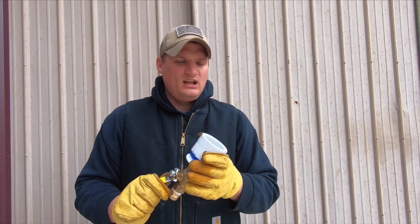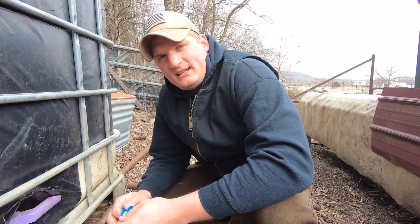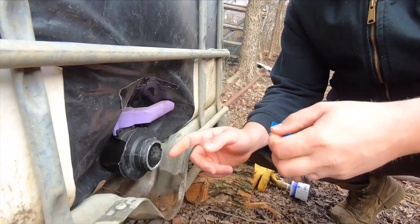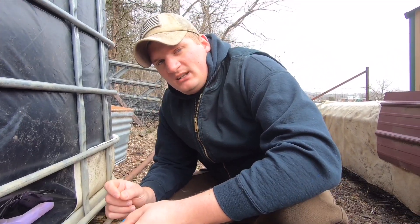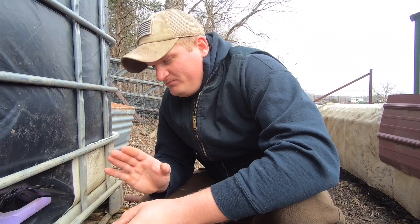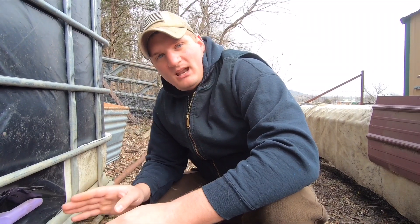We're on one of our last steps. Let that PVC stuff dry - I like to just let it dry for a couple hours. I don't know the exact time, I just like to be safe. Just wait a couple hours, let it dry up, and then all you're going to do - you got this piece that we just made. Literally you just stick this one in there and turn both ends until as tight as it can get. And you got yourself your spigot, and a really good one too. This is nice - it's all brass or galvanized steel, it's going to last a while and be very durable. It's not plastic, this is schedule 40, so it's going to last a lot longer than that plastic handle. There's just one last thing - I'm going to put some Teflon tape on the threads here. I have put spigots on before and it does have maybe just a drop every now and then. It's not a lot to worry about, but I just want to seal it up nice and tight.